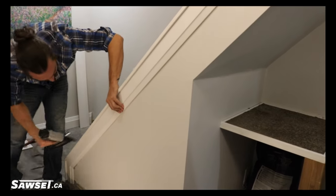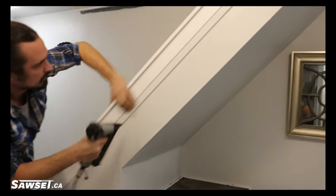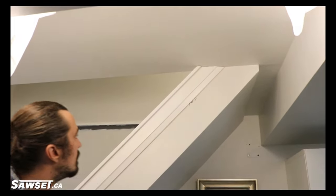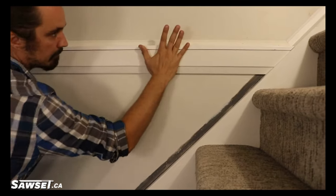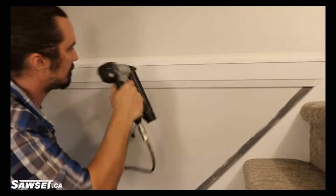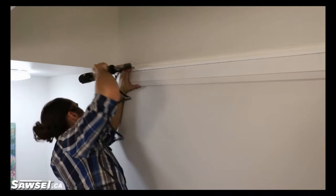In this case, it wasn't really that important to me because I'm going right into the stairs — I know there's wood backing right behind there, so I'm nailing wood directly into wood. Say for instance you're in a situation where you are just nailing straight into drywall and you're not confident if you're hitting studs or not. A good tip is to always shoot it on an angle in two different directions — one one way, one the other. It's kind of causing a forking effect, giving you an anchor, like a drywall plug. It kind of anchors into the wall, and that should hold your trim as tight as it needs to be.